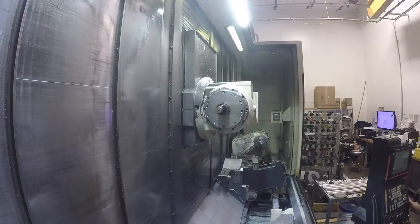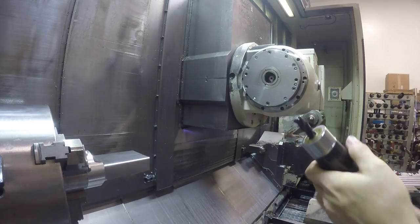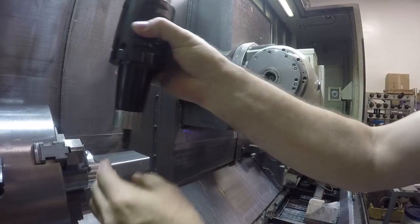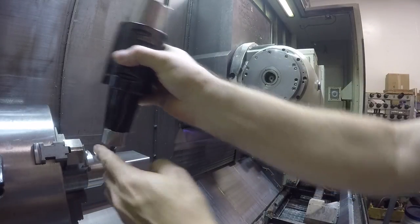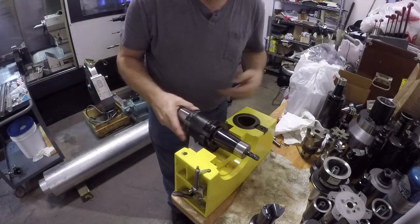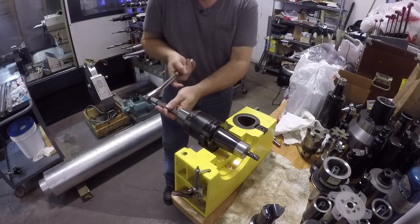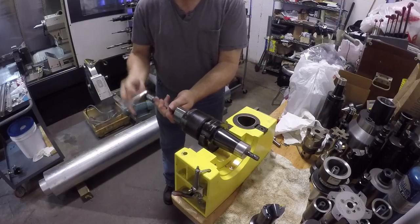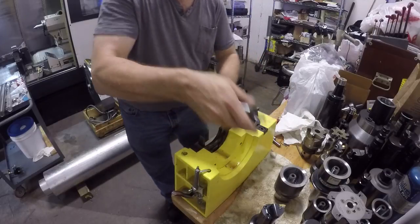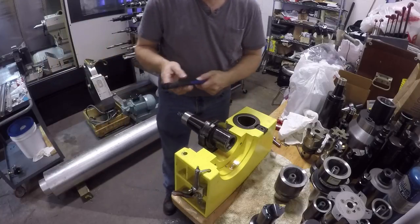Here I had to set up a new tool — a half-inch end mill. This tool had a radius on it I didn't need, and the tool holder was longer than needed, so I took the extension off. This Capto tool holding system is nice because you can extend or shorten tools as you want and it still runs true and is very rigid. You can see the shank — it's kind of a trigonal shape, which is good in a multitask machine because it helps orient the tool when the spindle clamps for turning tools.